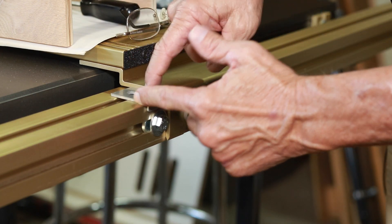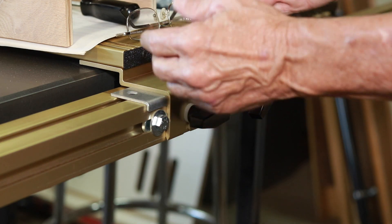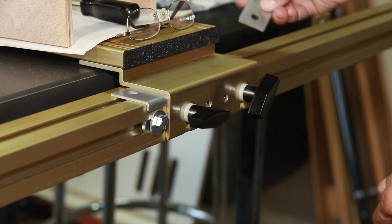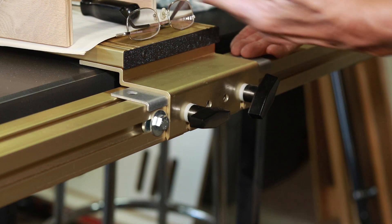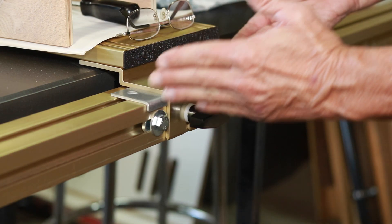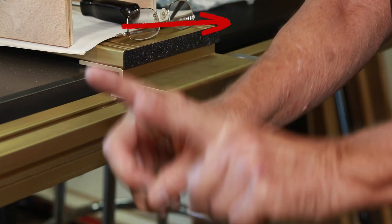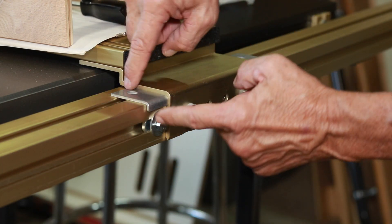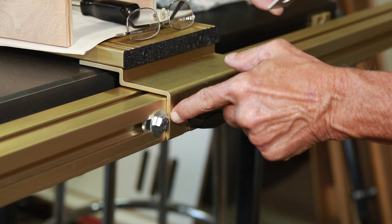I'm choosing to use the floating stops as permanent stops for the base to go back and forth. When I slide it forward it's going to stop right here — that's going to be my zero. When I go back 20 inches, that's where it's going to stop in the back. That will be when I need the full capability of my table saw and get a 52-inch cut, but I have to slide the whole base back. This just makes more sense to me — I have all this surface now contacting the base versus just that little spot.